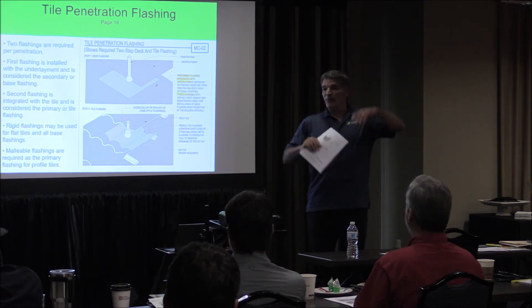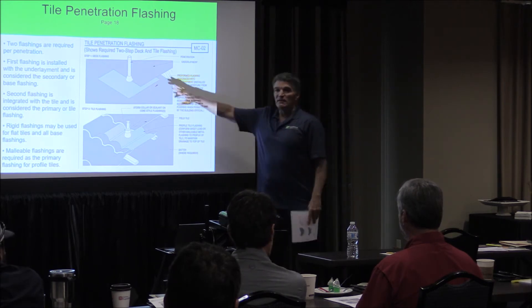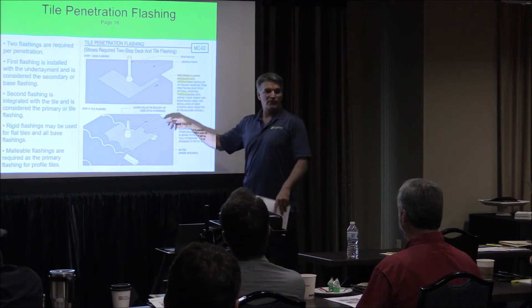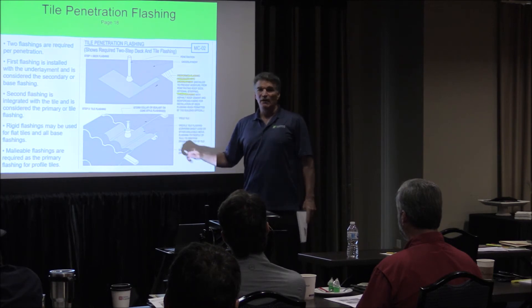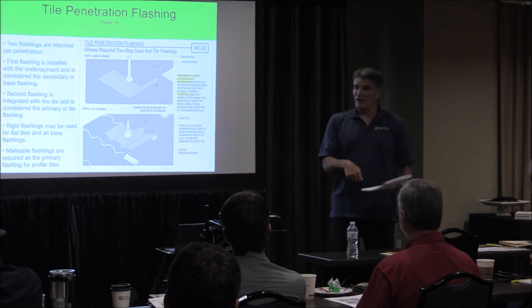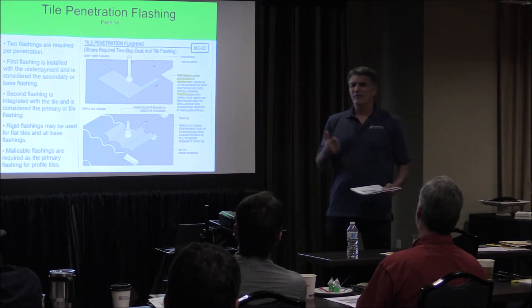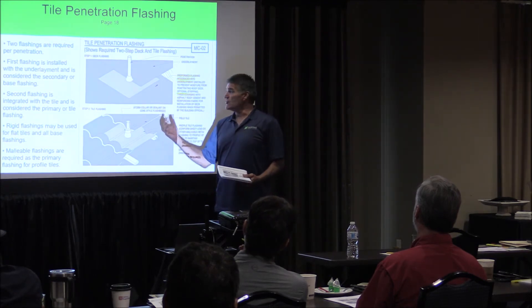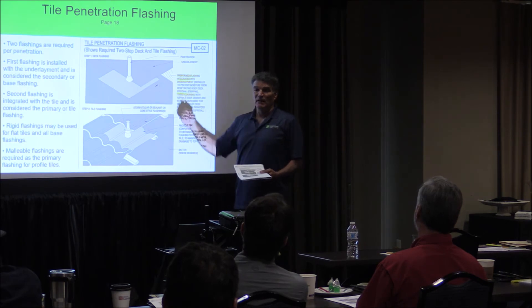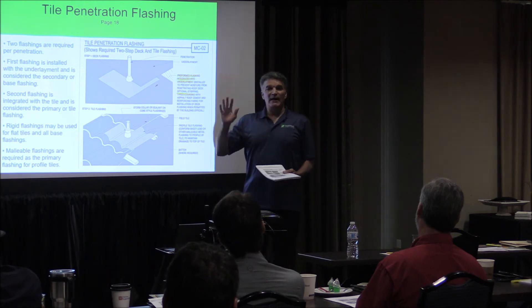Once we get to that point where we understand what Lisa's telling you — you've got this tile roof and a backup system — she's delivering this to you and having you highlight something that says one inch out, four inches, one inch past the ground below. That all matters. Those are the minimum standards. When we sit down and cut out our underlayment or asphalt shingle or tile around our flashing, it would look right or it wouldn't look right. There's a number in the book that tells you whether it's right. When we have a pipe flashing, a pipe that pokes through the plywood, goes through our underlayment, and goes through our tile — we're going to roof that pipe twice.